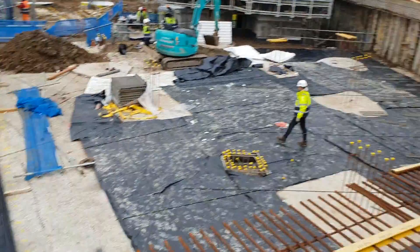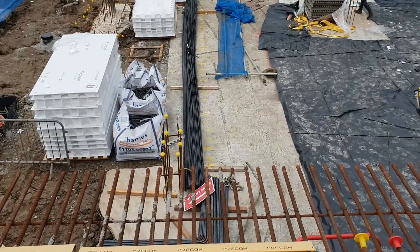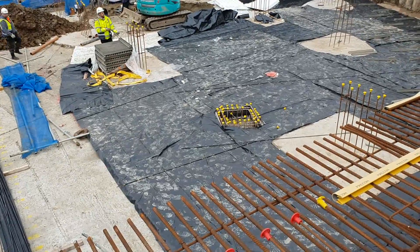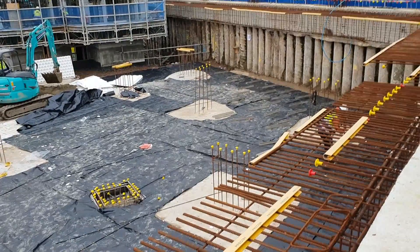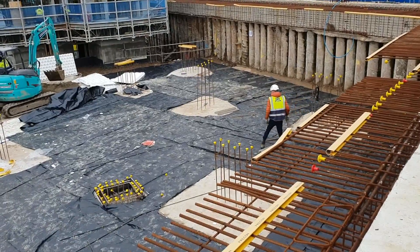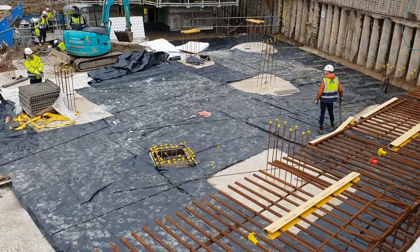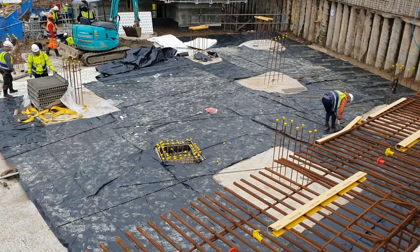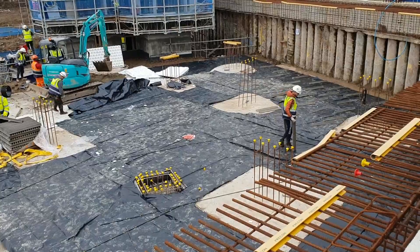So guys, the blinding is poured - it was poured actually 120mm lower to allow for the cordek to be laid underneath the slab. The first thing you see is the steel fixers laying the concrete spacers, which are going to provide the cover for the bottom steel. And there's the manhole here - it's already in, it's going to be boxed, installed and poured with the slab.